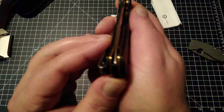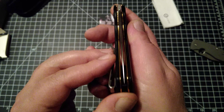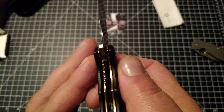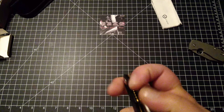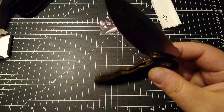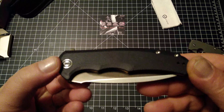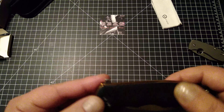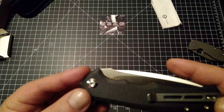Centering on this — it's perfect. Absolutely perfect. It is a liner lock and you can see down in there it looks like we're getting about 30% lockup, which is perfect. Super smooth action straight from the box — once you get past that detent it pretty much almost just drops shut. The G10 scales are very well done, everything is kind of deep chamfered off with no squared hard spots anywhere other than the pocket clip.